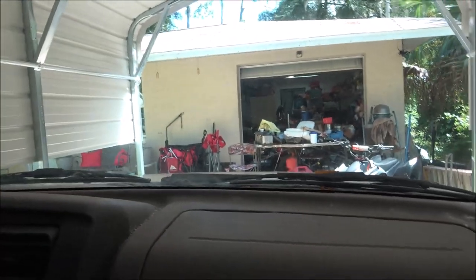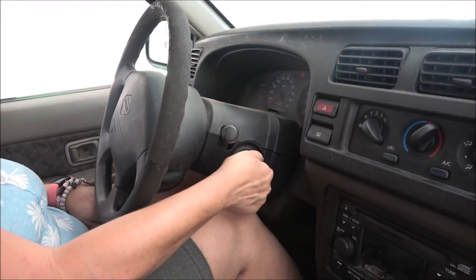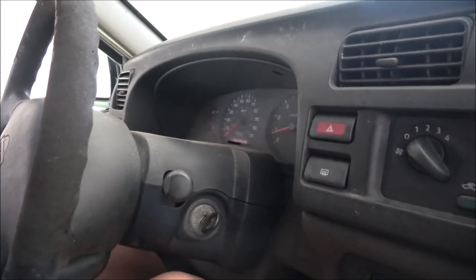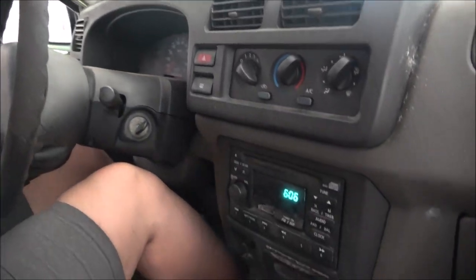What I'm going to do is take the battery out of the boat and put it in here, then put a new battery in the boat. The one that's in here right now won't take a charge as a return. Let's see if it'll start - yeah. I checked the alternator - it's putting out 14.5 volts. Oh look, all the lights went off, even the gas light came on. I'll have to do some work with that float in the tank.